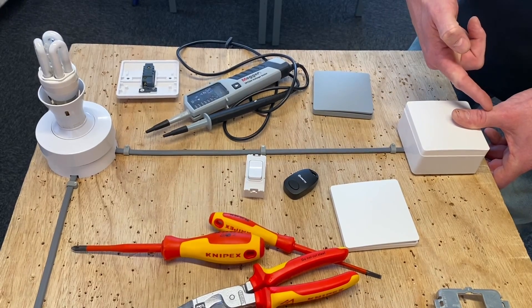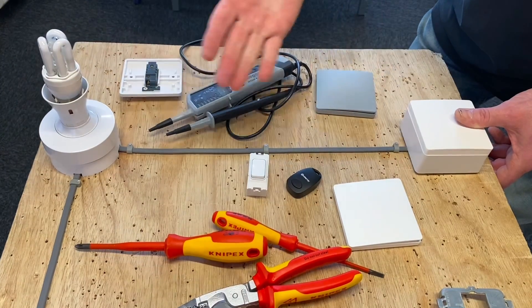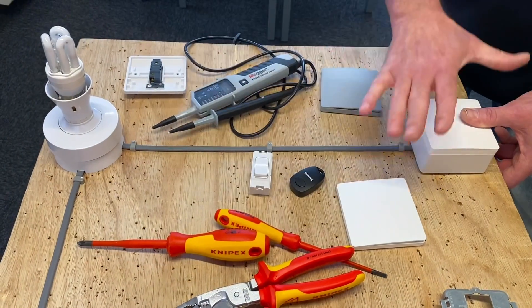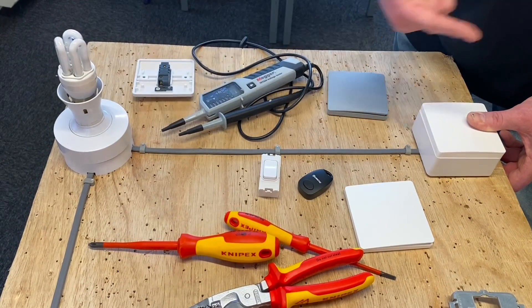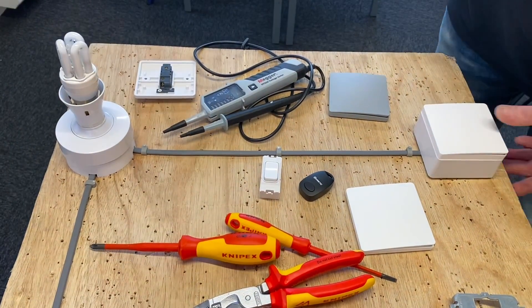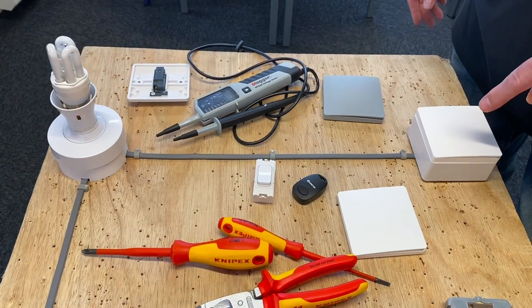Let's see that. We press and hold the switch — we'll first see it go into pairing mode, but keep holding down. When it starts to flash, that's the pairing mode we saw in the previous video. I could add more switches now, but we want to go beyond that — we want it to forget the switches it's got and just leave us with the original receiver one-way switch. You can see it's not flashing now, so it's cleared itself.